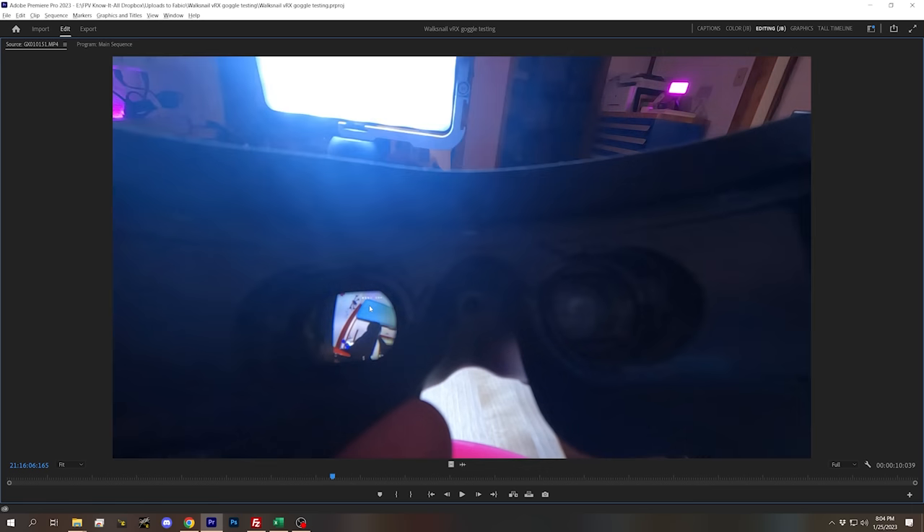This method is not perfect. Because I only have a 240 FPS camera, I can only measure down to 4 milliseconds of precision — so if one goggle had 6ms and another 8ms, I couldn't reliably differentiate them. There's also ambiguity in which frame should count as the start of the light turning on, which could throw off the count by one frame. I've ordered smaller LED diodes that will turn on more quickly and definitively. Nevertheless, we can still draw meaningful conclusions.